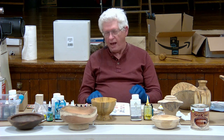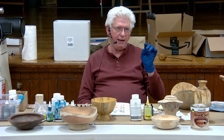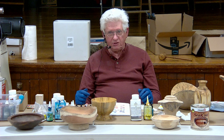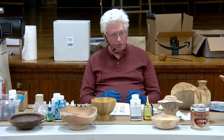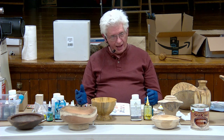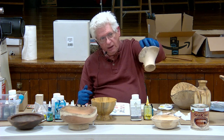This piece of ceramic is my test balloon a lot of times. I'll put down a base, put down a top color, and see how they're mixing. They mix in such a way that the top color solvents the under color — so I can take that first color and make it totally disappear by putting too much of the second color on. I can create an edge by putting the second color over the first and having it run. The finial on that piece is a white piece of maple that just had no life to it, so I enhanced it with this technique.